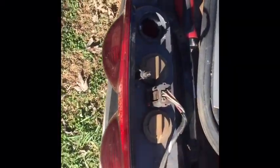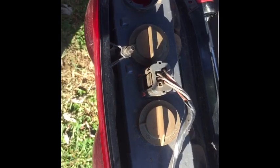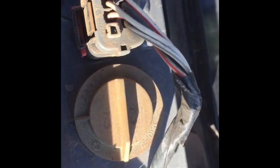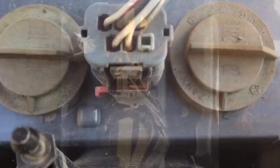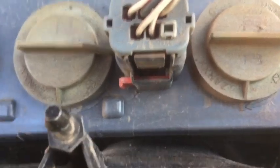Now to remove the electrical wiring so we can take this housing and put it on a bench and work on it. There's a little red lock tab that you'll see right there — it locks the electrical connector so that you can't just slide it apart. The easy way to get that out is to take a screwdriver on this end and simply pull it up to the side. You can simply pry that out to the side and that'll open up that electrical connector.